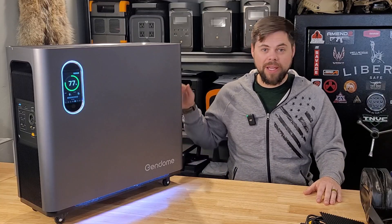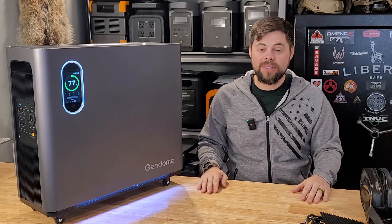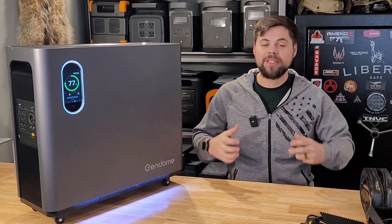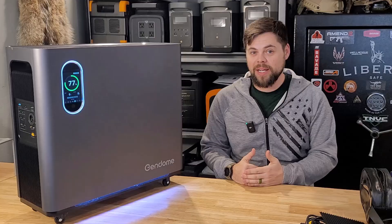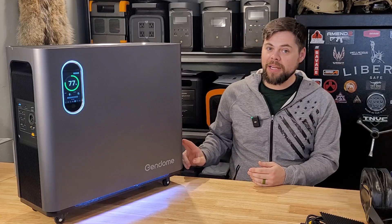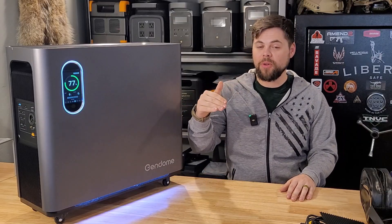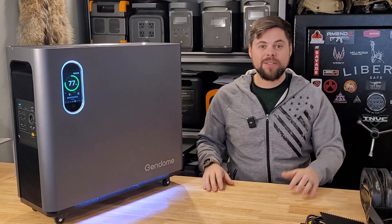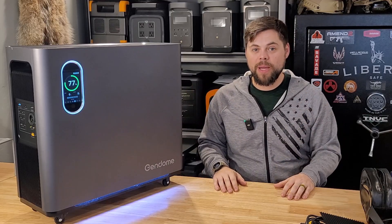It is really nice to be able to plug in another 200 watt panel into the wind port and get that extra little boost, because that can make the difference of over a thousand watt hours of extra energy — that's about equivalent to running a fridge and freezer non-stop for five hours. All in all, I think it's a really good system. This is one I'll definitely recommend if you just need 120 volt power and you're looking for a little bit of expandability. Keep in mind that once you've added one extra battery, you're about at the max limitations of its ability to charge from zero to full in a single day while still running your most vital equipment — that's around 6,000 watt hours of battery capacity.